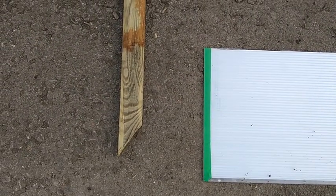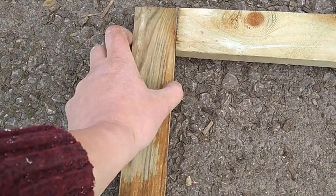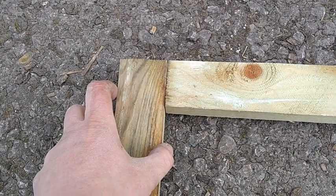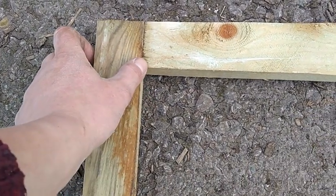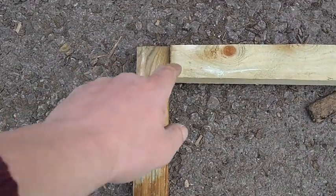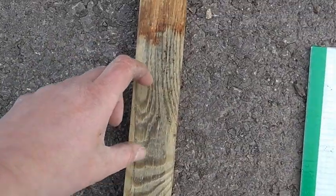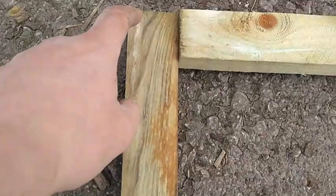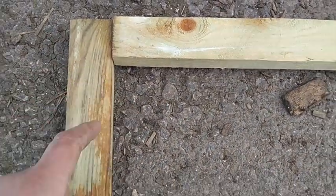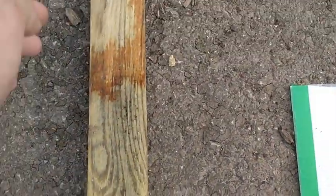That's an offcut. Now we're jointing up the butt joints, but they're going to be jointed butt joints, so they overlap. So that's going to go like that, but then on this end, because it's a foot wide, that's only got to be 10 inches. I've got to cut that to 10 inches, so that the next long length will be here on this side, so it'll go to the end here.